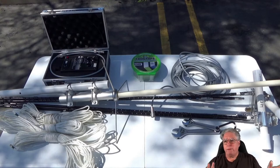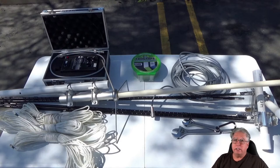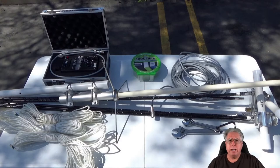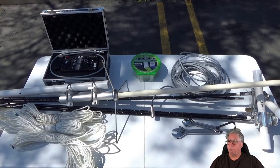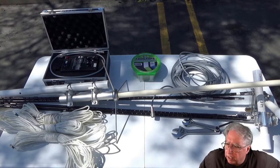You assemble these — basically you notice I've got a couple of wrenches here and some frog tape. Notice over in the corner I actually have an antenna analyzer, and after I get these up in the air I always throw them on the antenna analyzer. Why? They're sitting in my closet, sometimes months, and things can happen. The coax could loosen up or I could have damaged it on the last deployment and not known it. Using an SWR meter or antenna analyzer is an important part of your setup. You can check SWR with a regular old meter — much less expensive — but this makes it easy to check the antenna's status before I even transmit on it.